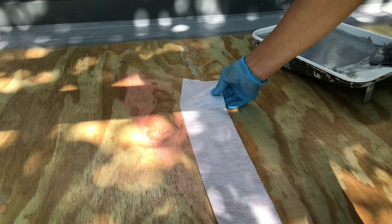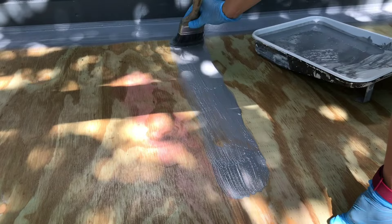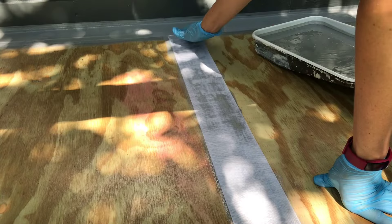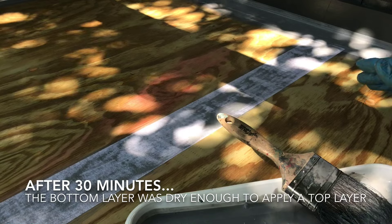This is where two pieces of plywood butt up against each other, and to prevent any possible leaking I'm applying the geotextile here. This stuff feels more like you're applying a coat of pudding — you want to go really thick, so don't be shy. Then you press it down into the Liquid Rubber, smooth it out, and make sure there are no air bubbles or creases.